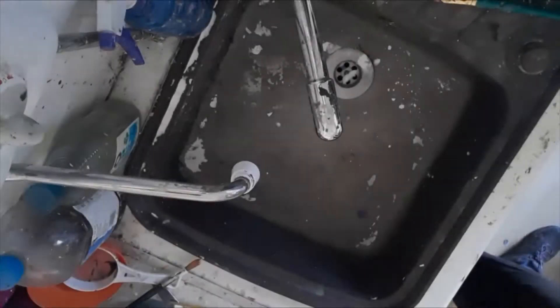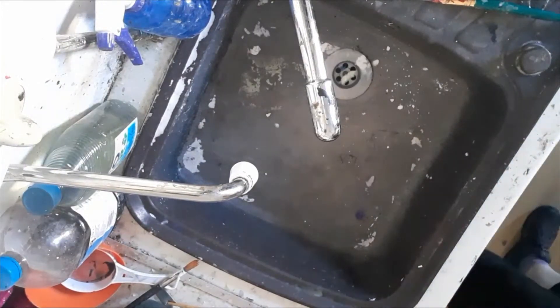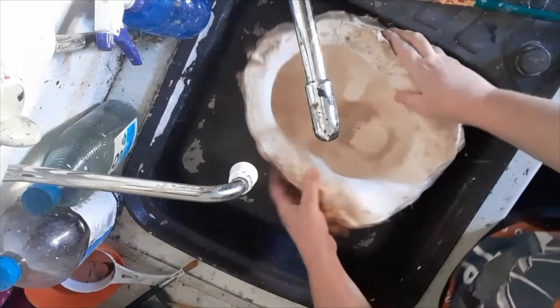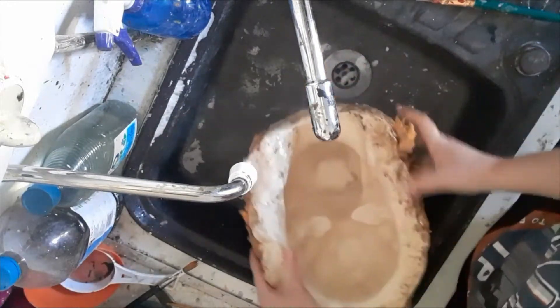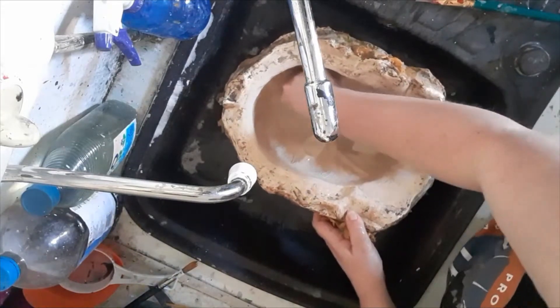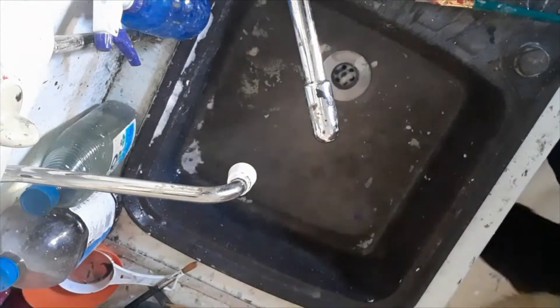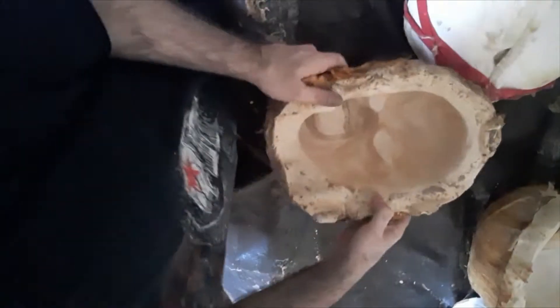This is from an existing mold we already have, so you're not going to see any sculpting today. To start with, we just grab the mold and we rinse it out. This is to allow any surface air that's trapped in the pores of the plaster to be pushed out by the water, so when the latex dwells in the mold it doesn't get any air balls trapped from the plaster itself.